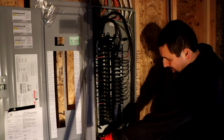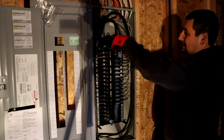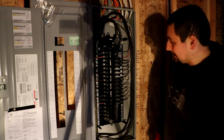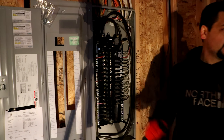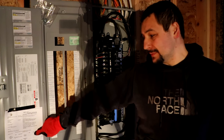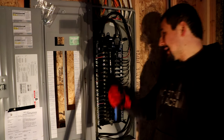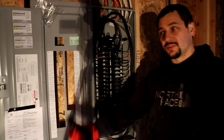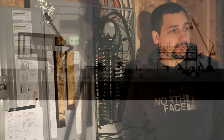You can see the main wires come in through here, routed up and around and plugged into the main lugs and the neutral on the ground — that's what it should look like when you're done. That's how we hook up power. This all has to be inspected by L&I. The permit is hanging over here, so they're going to come back and inspect this hookup, inspect the box on the outside of the house, inspect the trench, sign that off, and then we'll cover this all up. And then we're done with electrical.